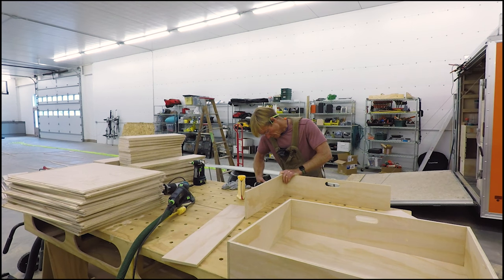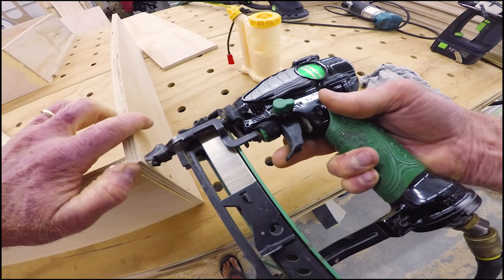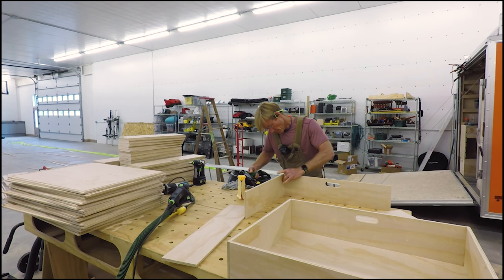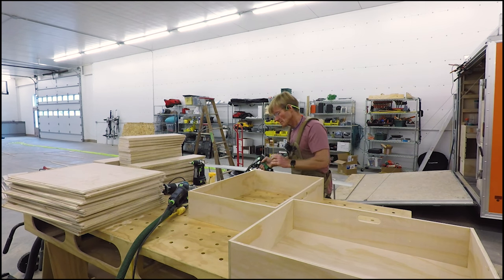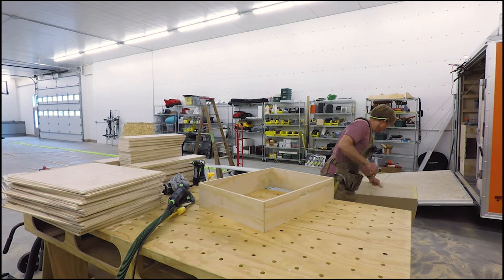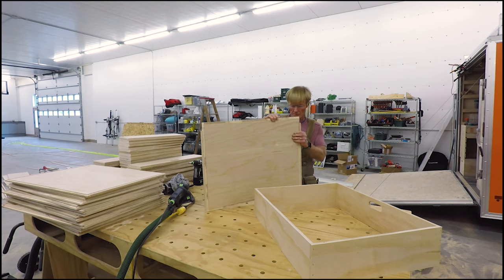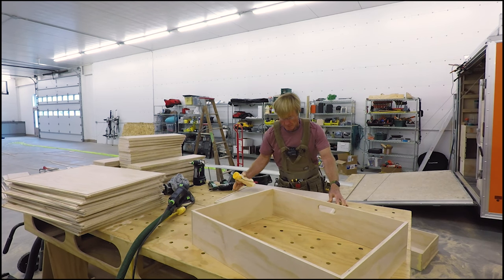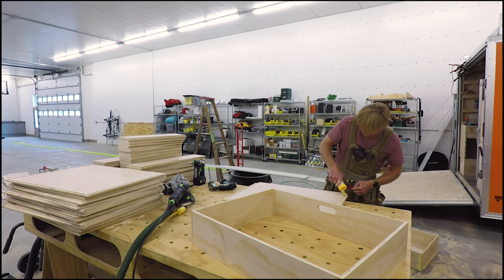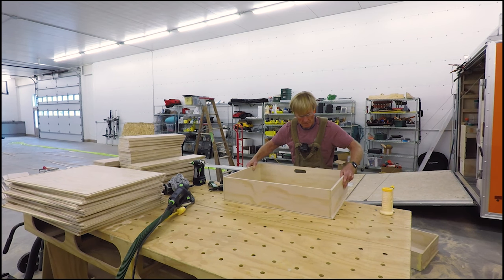Now I'm assembling the drawer boxes. Just like with the narrow ones, I glue and staple the sides — the staples being perpendicular gives a little more strength when pulling on the drawer, and the glue does the real holding work once everything is set. On the bottom of the drawer, just like with the shallow-depth ones, I took advantage of the rabbets and dados, which made assembly so easy — just fill them with glue and put the sides in as one unit. My methods changed a little as I went; you try different ways and find the most efficient approach.